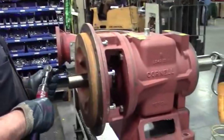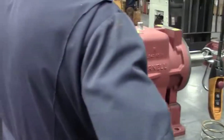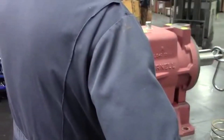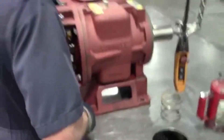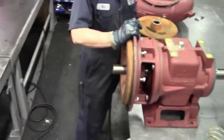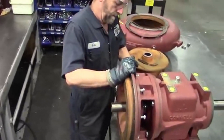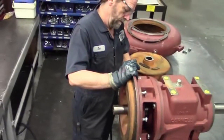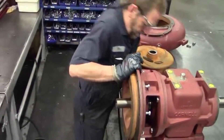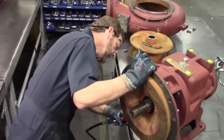When you put the bolts back into the back plate, you want to make sure you use anti-seize. The anti-seize will help in the reinstallation and removal of the bolts if you ever have to pull it off again. Everything from the factory is anti-seize on all the bolts that go into the top.